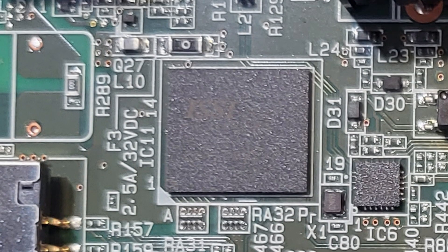This one above that is really hard to tell — even with the unit off, the actual text is very difficult to read. What I could get out of it was that it's an ISSI, which is Integrated Silicon Solutions, a California company that manufactures static RAM. SRAM is volatile — it loses data without power. So I assume it's a caching system for quick operations, maybe where it's loading things when you're opening a file to edit. The best I got off the numbers looked like 2047, then IS2ES160 — I couldn't find much about it.